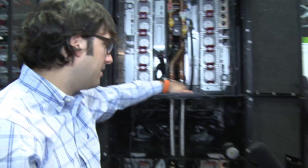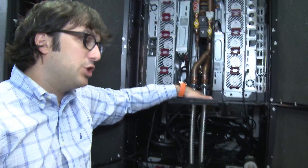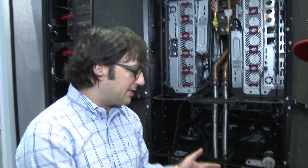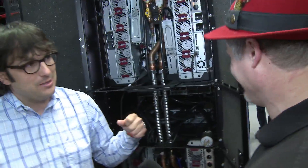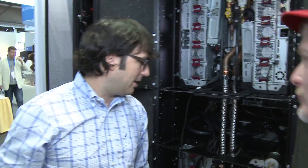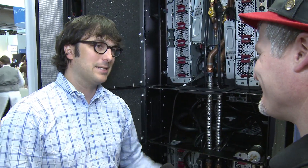What's also really interesting about our secondary plumbing is that although we think we have the most fault-tolerant implementation of liquid cooling, just to be sure — if any of those pipes was ever to get loose — we implemented the secondary loop so that the water flowing through the rack runs under vacuum, at sub-atmospheric pressure. Why does that matter? It means that if you were to cut a pipe and it was to leak water, instead of leaking water it will suck air into the system. Almost instantly we'll detect it on our monitoring system and alert that we have a vacuum leak — giving us plenty of time to fix it without ever dropping a drop of water. Our first customer, the National Renewable Energy Lab — Steve Hammond — goes around saying it's been 18 months now, not a single drop of water on the floor, even with the prototype.